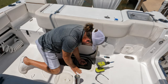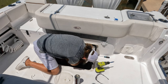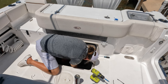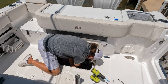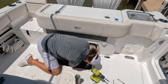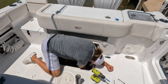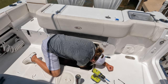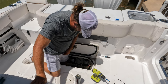I'm going to connect the Deutsch connectors right now so I don't accidentally get any water in them when I do the water hoses. Slip the end of the hose into the side of the pump and just manually crank it on there. Side A is on — take your time, put it on, make sure you don't cross-thread it because it's plastic. Side B is going on. Okay, that pump's in and ready to go.